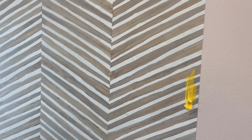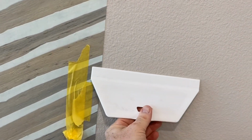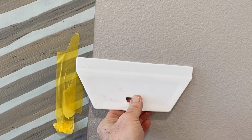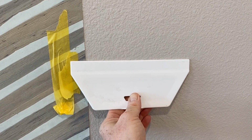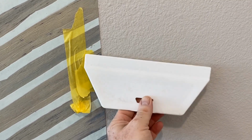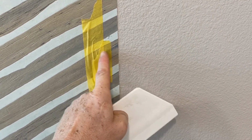So, do you understand? I'm going to put the next sheet up, overlapping. This is going to be called my underlap sheet. This is going to be my overlap. I'm going to overlap it 1 inch onto the next sheet. And I'm going to trim it at that secondary edge. And that'll only take a 1/2 inch off of the old sheet, right? And a 1/2 inch off of the new sheet.